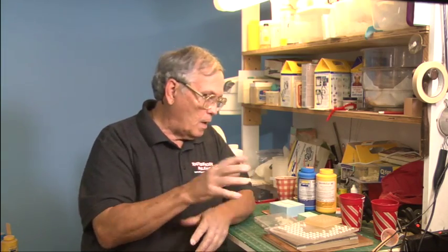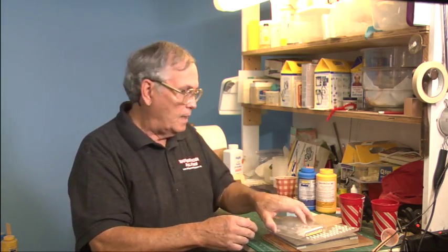I never want to have to go back to that master part, and preferably not back to the master mold unless it's absolutely necessary — like if I have a fire and ruin all this. Then I can go back and recreate my parts. But I want that master off-site someplace where it can't get ruined along with everything else. So just a word: if you decide you want to do this for a living, you need to understand the concept of a master and a master mold, then a production mold, and then the actual mold that you're going to produce the parts out of.